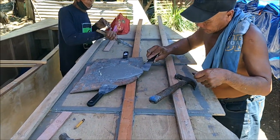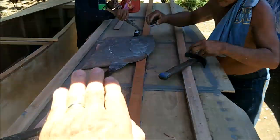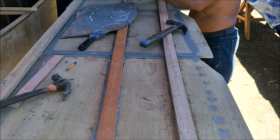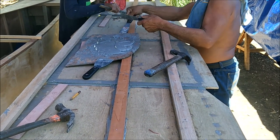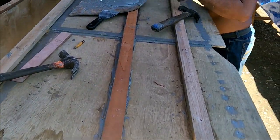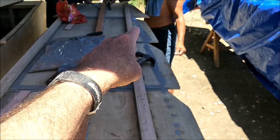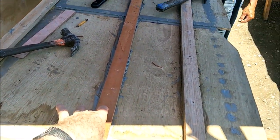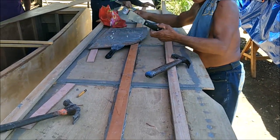The bottom is flat, completely flat, so when you go into a turn the boat can still keep sliding forward or sideways. These — I call them chines, some call them ribs — we're putting these on so the boat goes straight, and also so whenever you land on sand they act as sacrificial pieces and don't scratch the paint off the plywood. We can remove these and put a new one on, but taking the plywood off is massive.